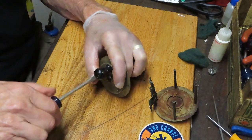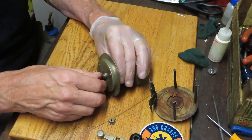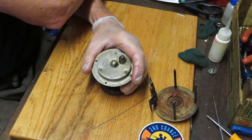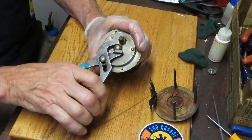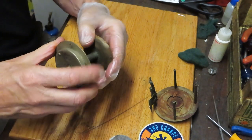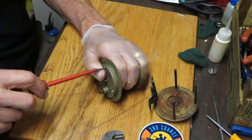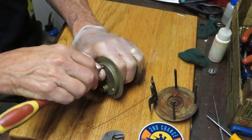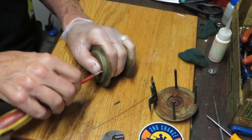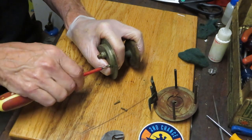This is interesting. We're going to take the handle off — sometimes you can push these whole assemblies through. You can see there's a whole host of issues there. I'm going to pull this adjuster cap. When I take my pieces and parts off, they go on a parts tray. We're getting some spacing here, so in all likelihood there's a bridge that's holding this on with these three. One thing I do want to encourage you to do is take pictures as you do a disassembly. That way when you go to reinstall, you'll have a reference point for what came out, when it came out, and what the orientations were.